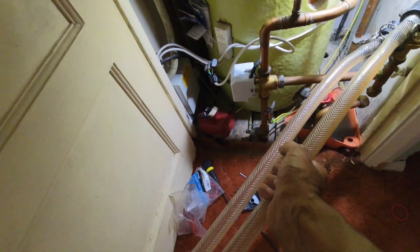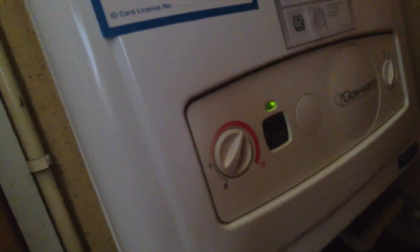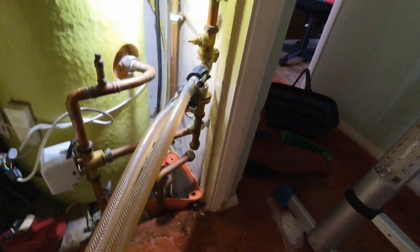We're finally up and running. It's warm here, warm here - this is cold, which is what we want because I'm just running it through the heating side. I've got the boiler on as well - you can see the green light on there, that means the boiler is running. I've turned the heated element off on the power flush machine because you don't need to burn both ends. This is our flow going down the heating side, and this is our return coming back from it, locked off with the butterfly valve. I'm going to have some lunch, and then we've got an hour of circulation before isolating all the rads to get the system nice and clean.